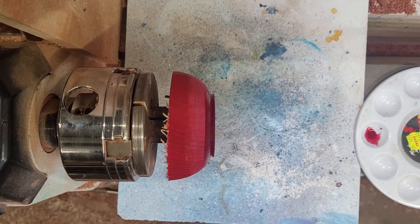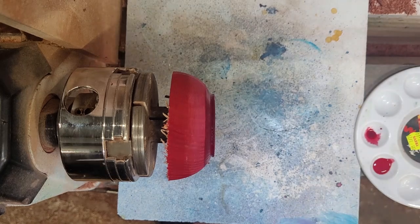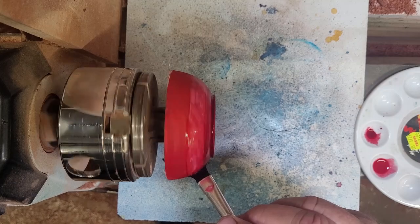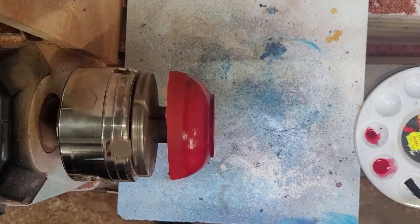I thought about using a Sharpie, but my experience with the Sharpie is if I decide to put a lacquer over the top of it, the colour from the Sharpie then runs. So if I put a black acrylic, just a poster paint on a fine brush, acrylics once they dry don't run when you spray an oil-based lacquer over them. Whereas, and also be the same I guess for oil-based paints, wouldn't run if you put a water-based lacquer over them.